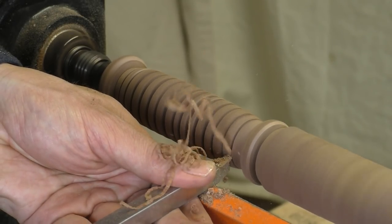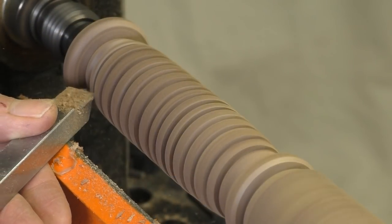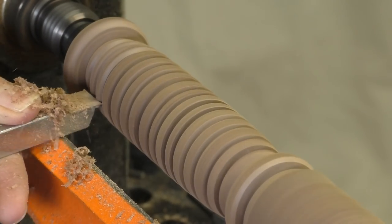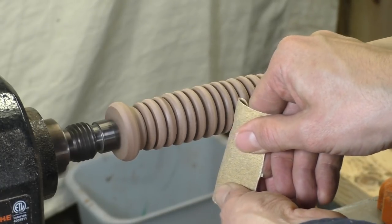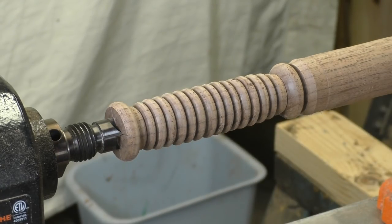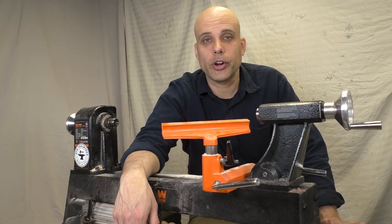After shaping I go back to the diamond tool and deepen the grooves on the ends. The little beads in the middle are too flat, the edges are too sharp, and they're too small for the round tool to fit in there. The corner of my square tool fits perfectly into those grooves and I can swing the handle around to make a nice smooth curve. I work my way all the way down the piece rounding over each little detail. When I stop the lathe I see that the finish is very rough — the wood has chipped a lot and I'm not going to be able to sand all that damage out. Walnut was the wrong choice especially for these carbide tools. They cut with a scraping action and work better with denser woods. Walnut is a hardwood but it's not very hard and it's not right for this project. Learning experiences like this are only going to make you better at turning.